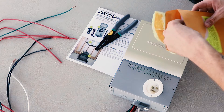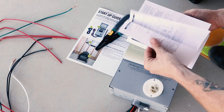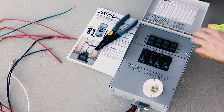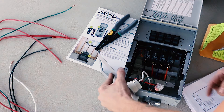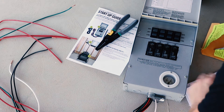Now that we've got the safety talk out of the way, we're going to install the transfer switch. I read over the very short instruction manual, taking note of every wire and connection being referenced. The breakers are rated for 15 to 20 amp, with the option of switching out the A/B positions for a larger breaker — say a 30 amp — in the future. Since I wasn't switching anything out, I made sure the outlet was wired correctly and took the whole box over to my main service panel for mounting.